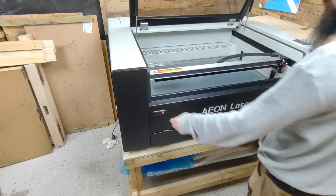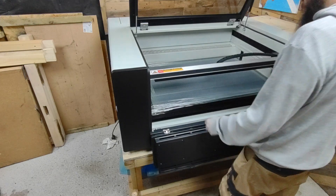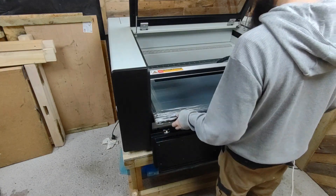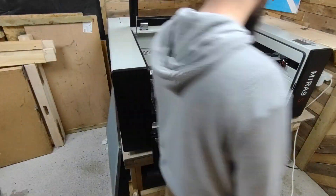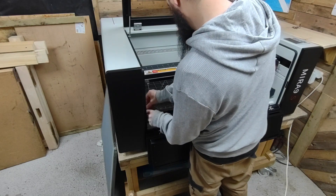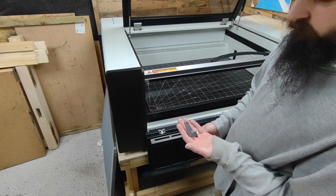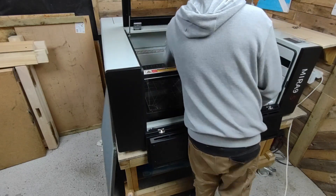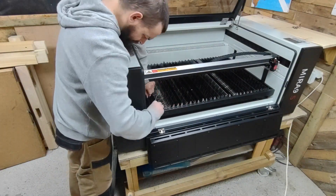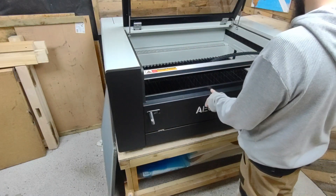Once you've got all that sorted, we'll jump to the front of the machine where you can see the front access for the pass-through doors. Then we'll pull out the honeycomb bed. Once you've got the honeycomb bed out, it's time to remove the corner brackets from the main bed itself using a simple allen key supplied in the kit — two allen bolts in each corner. Once you've done that you can start standing up the blades for the blade table. It's dead easy — they just flip onto their side and then you click them in on the front side.